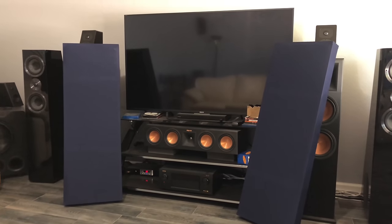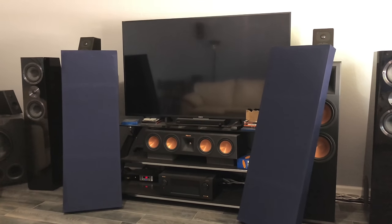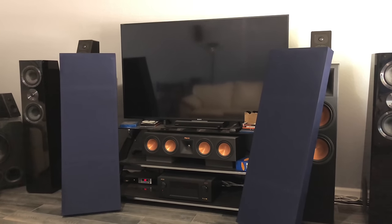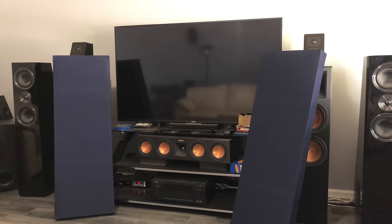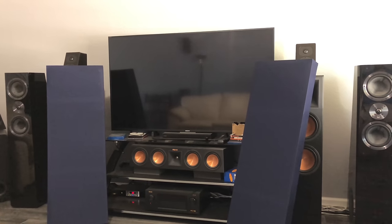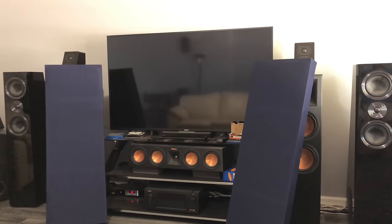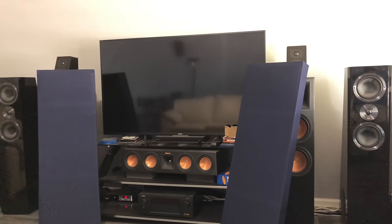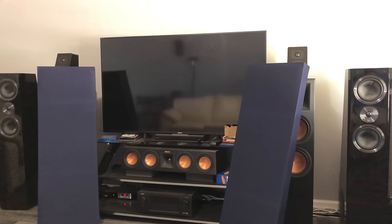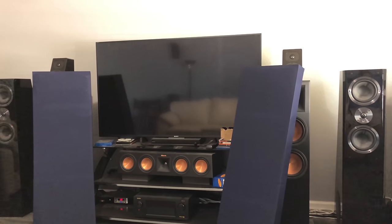The panels are really easy — you don't need a whole lot of equipment. You just need wood. I use Safe and Sound from Rockwool, and you can also use Owens Corning 703. Those are really good for the actual acoustic panels themselves. If you want to make bass traps, you're going to double up on the Rockwool and add them front to back, use a thicker piece of wood, and use Owens Corning 705. Different materials for different purposes.